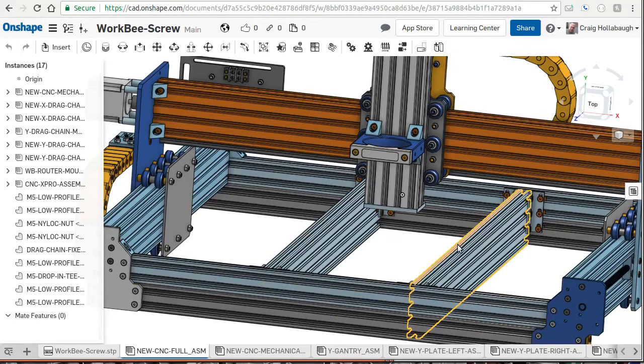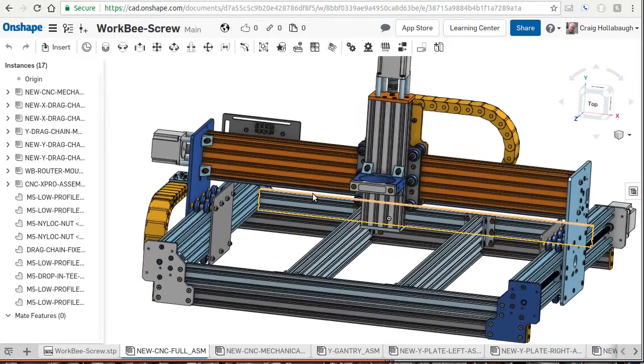Well, I was telling you about the orientation of these last 3 members here to hold your surface up. In this configuration, your work surface is a lot higher up, closer to this pivot point right here on the Z, and so it's going to be more rigid and more accurate. But I want to have some distance there so I can carve out fairly large depth in Z. So you basically flip these things and then you reorient this piece here, and you actually gain 40 millimeters in Z.